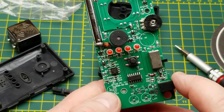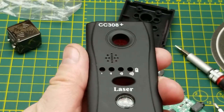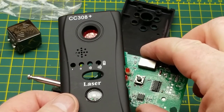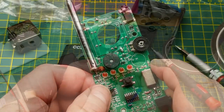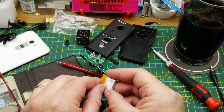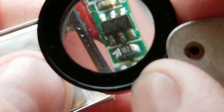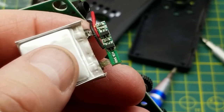Now that the board's away from magnets, the compass is actually pointing closer to north. But as soon as I bring the little speaker on the circuit board near it, it points straight at it every time. Let's peel the Kapton off the battery and see what's on the protection board. Wow, it's very puffy and came off easily — that's a bit concerning. It's a DW01 — a standard battery protection chip with a MOSFET, no real surprise there.